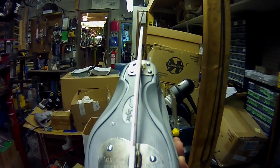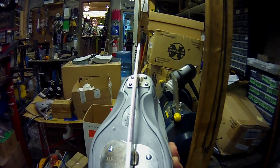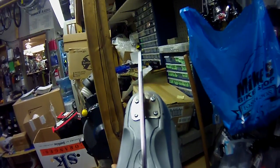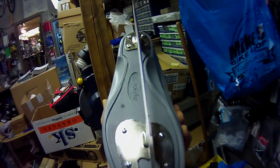Now we can see in the light that this skate has been ground to the side, because the grinding wheel on the CAG1 — which is always in the middle by virtue of its clamping system — is not grinding in the center. So this skate will require multiple passes to fix it, and then we'll proceed with the sharpening.